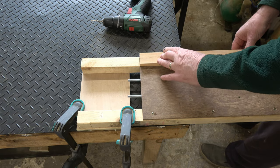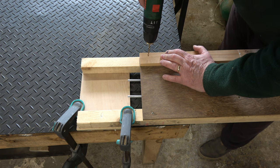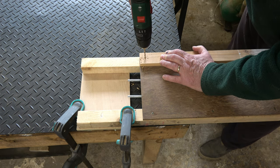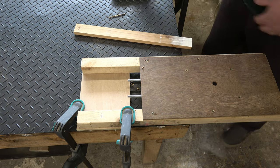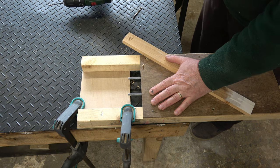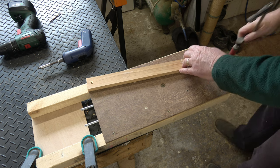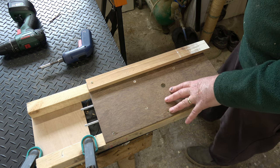Use a piece of wood that's slightly less than two inches — I've sliced this down slightly, another piece of reclaimed wood. I'm going to drill down through the tabletop and this leg, about half an inch from the end — no precision required, just drill down. Then I'll go for a slightly bigger drill bit so you can see the difference in sizes, and drill through the actual fence itself, not the table, so the screw will just slide through the fence. You just set the fence where you want it and clamp it in position — it's as simple as that. Basically, the router table is completed: you've got a fence, you've got a table, it's clamped down, it is solid.